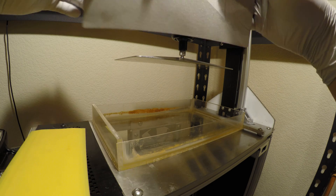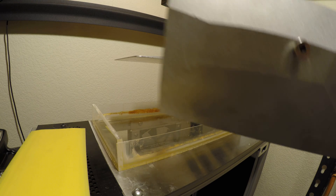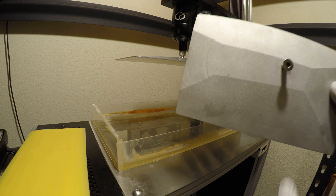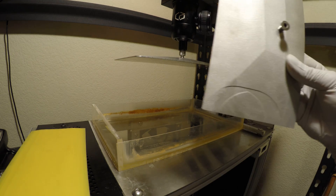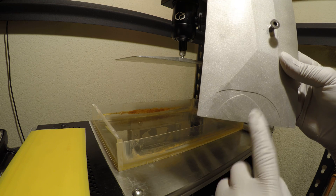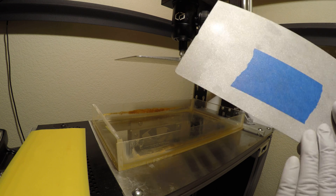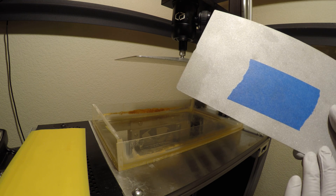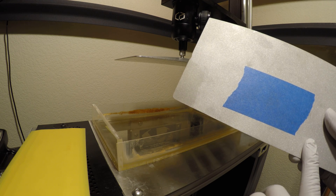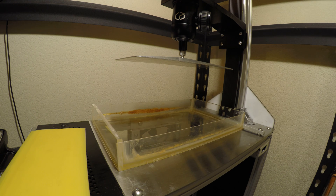It was done with a fly cutter — pretty scary to have this thin thing deflecting all over the place. My measurements were all off when adjusting the angle, so it just did not come out well. It is usable, although it has a sandblasted surface which is a bit too rough — it's very difficult to get parts off and easy to accidentally scrape up the build plate itself.